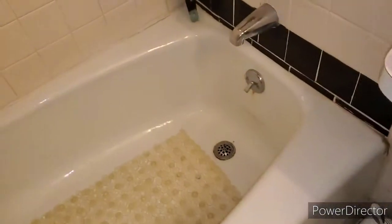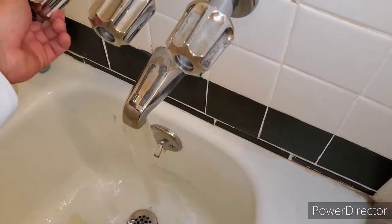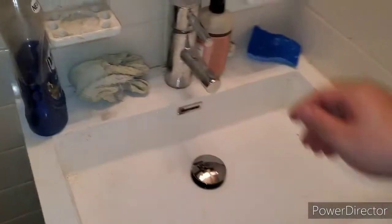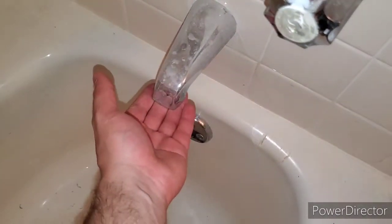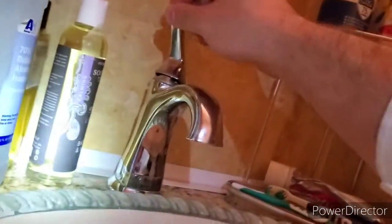We're going to drain here and break the vacuum — it's on floor 12. Now we'll go back down to floor 5 and make sure it's drained. We'll keep these open to bleed off the air at the top of the line. We're open here — we're drained already. That was quick for the hot water riser.